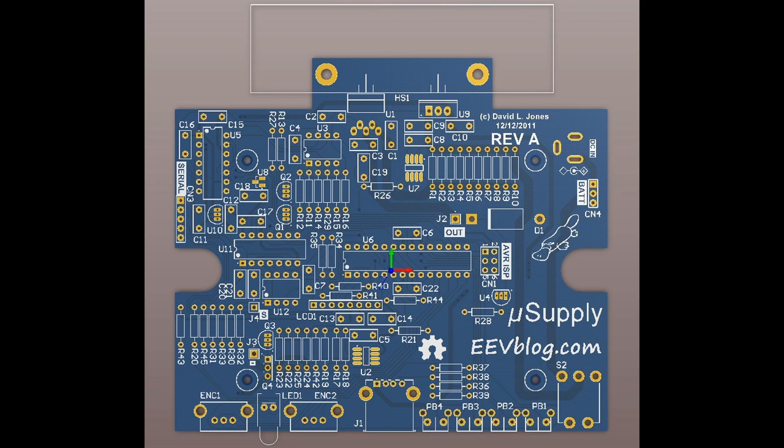Or in the case you saw on there, I think I added a bypass cap, just the nature of the layout, that I didn't think about or didn't get right when I was just laying out the schematic. So you might find that when you're doing stuff on the board, you might have to go back and annotate the schematic and make a few changes and things like that. But as you can see, I think it's a neat layout.